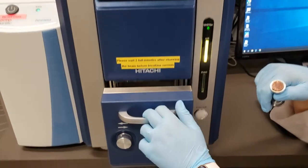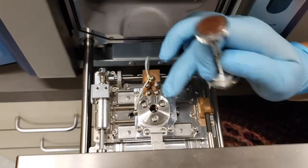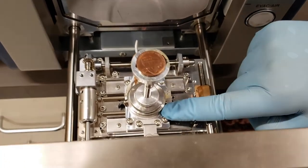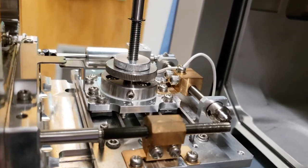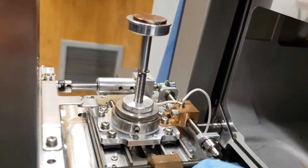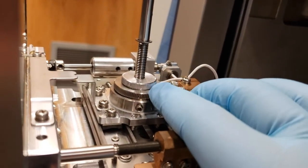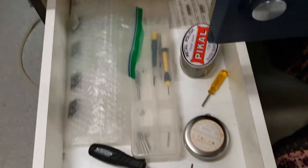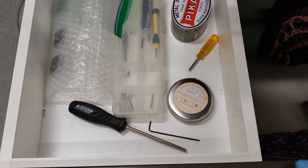Now the air light is solid, so we can open this up. The stage fits right down into this little hole. You want to make sure this piece is sitting flat all the way down — not sticking up too high. If it's up a bit too high, that's probably because of the little set screw inside. In the drawer directly beneath the SEM, there are Allen wrenches you can use to pull that set screw out of the way so the stage can sit all the way down.